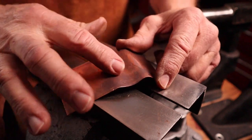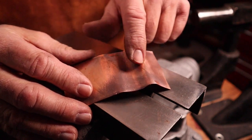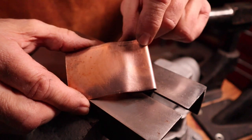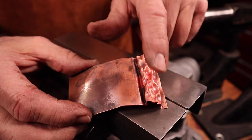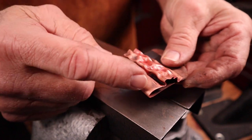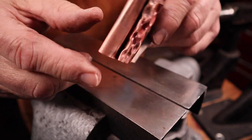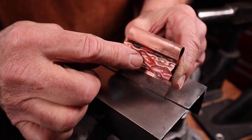Another method for making the texture across the entire sheet and making it nice and wide is to actually fold it two or three times and then blend the textures together. On the initial fold, you want to leave a longer leg on one side, then go ahead and do your texturing, then move on and make another line. You can blend the textures after the first round of texturing — move on and bend it over leaving a longer leg on one side, chuck it up in the vise and do your texturing. This is where the type of vise with the real small jaws comes in handy, because we can clamp right along the very edge and not disturb the existing texture.